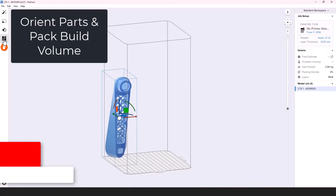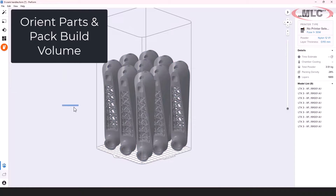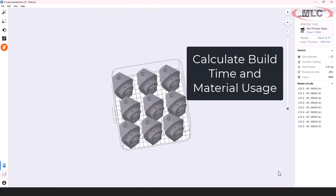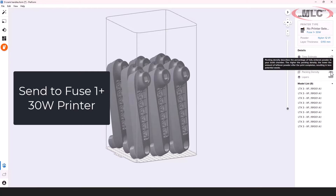Just like any other 3D printer, you'll bring in the 3D models in an STL format and set up where you want them and how you want them oriented. The thing here is you don't need to worry about orientation — they just need to fit inside. I like to use the analogy of taking all your parts and basically dumping them in a bucket and shaking it to the bottom so they all settle down. That's where they'll be when you print them, because you can stack them vertically, horizontally, whatever you want.